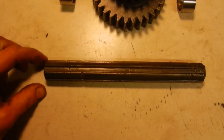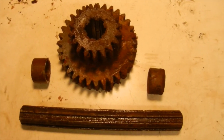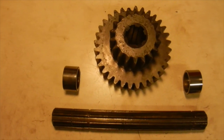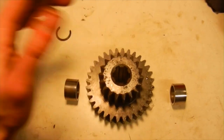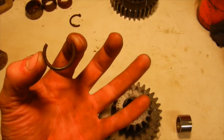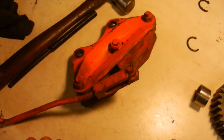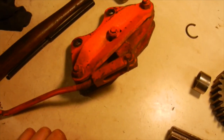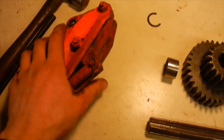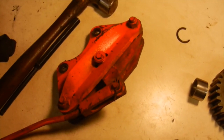Both parts cleaned up fairly nice. As you can see, hit the shaft here — aside from a little bit of pitting in the middle, not too bad. And the gear itself cleaned up fairly nice also. Where it was sitting in the mouse droppings and everything else down the bottom of the transmission, it's a little bit pitted and ragged-looking on the teeth, but aside from that not too bad — it's still good enough to drive the tractor around and be able to use it. The last thing I have to do is get some retaining rings for this shaft here that holds the bushings and everything in place, but I won't be able to get those until midweek when I go downtown for parts. So until then, I'm going to pull the other disc brake off the back — the caliper — and get those things cleaned up and working again, because right now it has almost nothing for brakes. When I roll it down the side of the hill by the garage, I was standing on the pedal and it wasn't stopping. So with the hill that we have out back, I'd kind of like to have brakes working on this tractor. Just going to pull them apart, do my general cleaning, make sure everything is lubed up where the mechanism is, and then hopefully we'll be back in working order again.